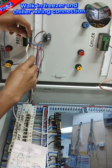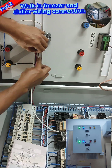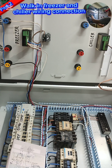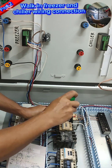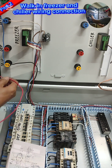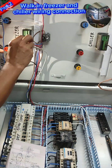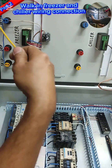Now working on the blower signal — the signal came from the Dixel on line number two — and I'm also going to supply the blower light indicator. Here I'm wiring up, and this white one goes to the contactor A1 coil. Just put a neutral and your coil is now supplied. As you can see, I am looping the neutral from the contactor and supplying the coil — as simple as that. You may apply this same approach to your circuit breaker with contactor in relation with the Dixel. I have a lot of tutorials on how to program both the freezer and chiller sides.